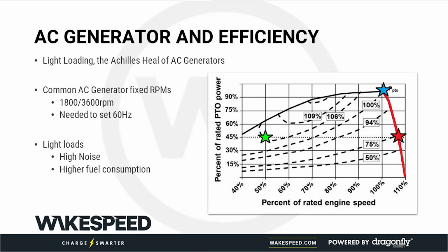But one of the things I noticed is there's a reason why tractors have like 96 gears. And that's because every single engine in the world has, and this is a very simplified view, an RPM, horsepower, and efficiency curve associated with it. The idea is you want to be operating up at that 100%, 110% point. You want low brake fuel consumption, BFC. You want the most usable energy output from your engine for every ounce of fuel you put in. That's why tractors have 96 gears.